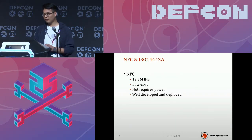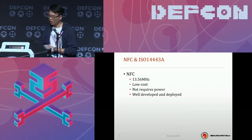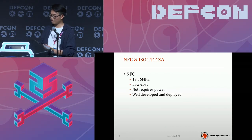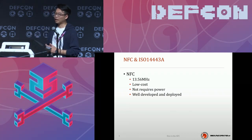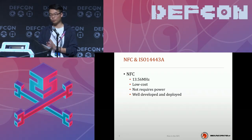I believe you are not inexperienced in near-field communication hacking, because it's widely used in our life, right? Your credit card, your ID card, and your security door card are all around us. The NFC card doesn't need power itself and takes the power from the reader. There are many protocols using NFC cards, such as ISO 14443 and ISO 15693, etc. But now we only focus our tools on ISO 14443, okay?